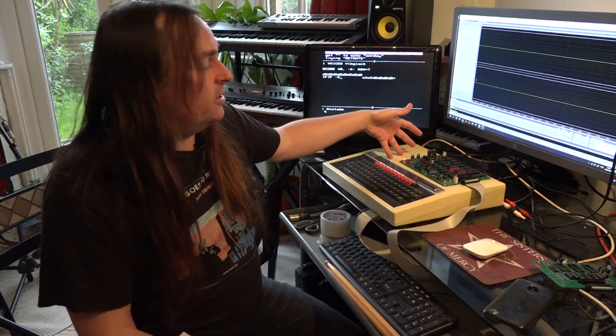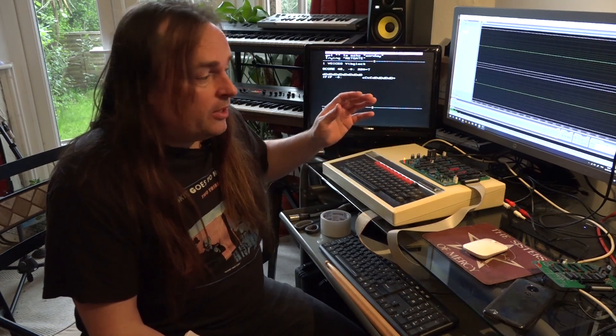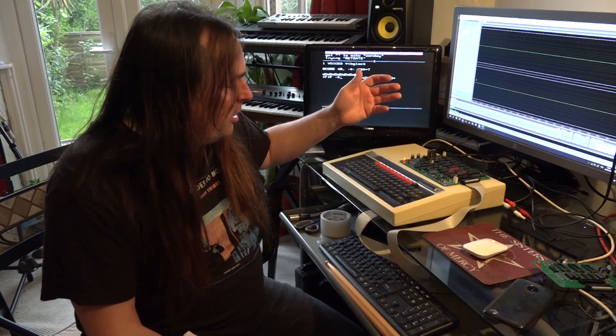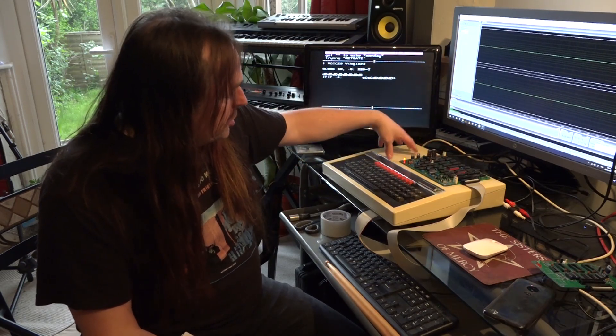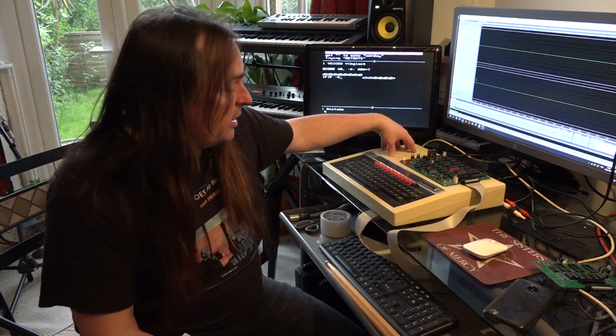I really enjoyed building this, and I must admit I did not think for a second this was going to work — and it didn't to start with. I couldn't get it to work. I reseated all the chips — that made no difference. I resoldered a couple of the joints on the board — that didn't seem to make any difference. But then I did the thing where I disconnected the power lead and plugged it back in again, and it all came good. So as a tip if you ever build one of these: switch the computer on first, then switch on the Music 5000, and it will do exactly as it's supposed to do.